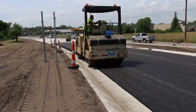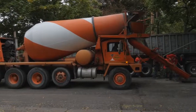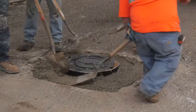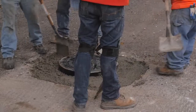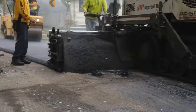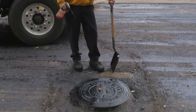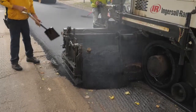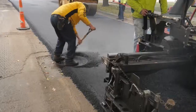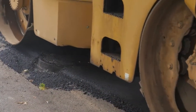You also need to take into account that the finished grade of the top course should be one quarter inch above curb and gutter after rolling. After final adjustments are made, inspected, and approved, concrete is placed around the structure and then finished flush or slightly below the leveling course in order to achieve a minimum of one and a half inches of the wearing course. This assures enough room for the wearing course placement around the structure casting. The final verification that the structure was properly raised will come when the top course is placed. The release agent sprayed on the structure cover should enable the HMA to scrape off the top course easily with a shovel. After final rolling, the structure top should be flush or no more than one quarter inch below the finished surface in all directions.